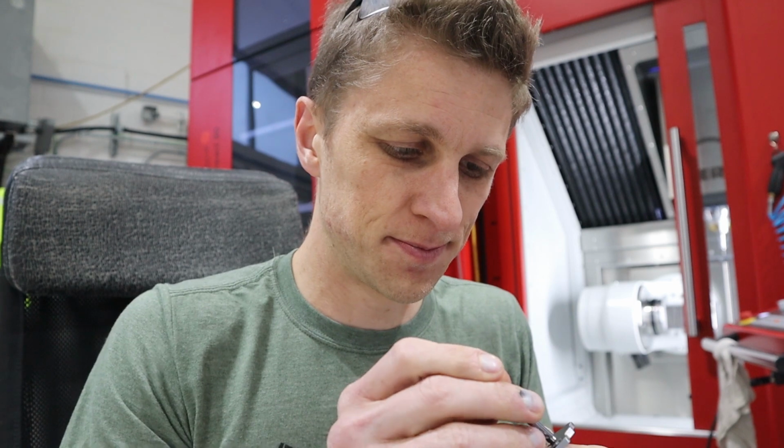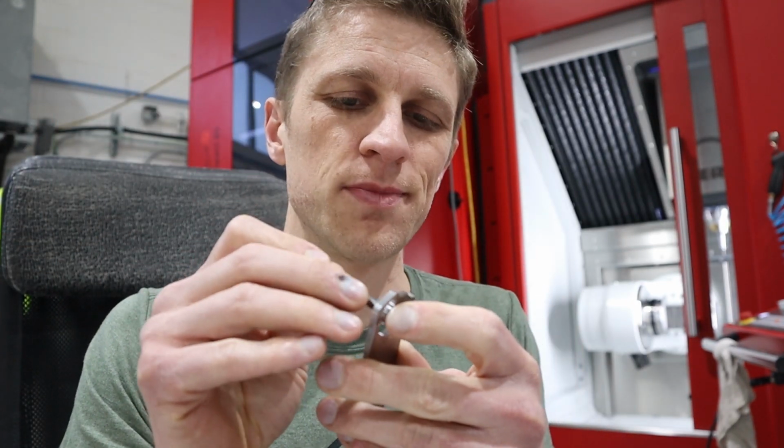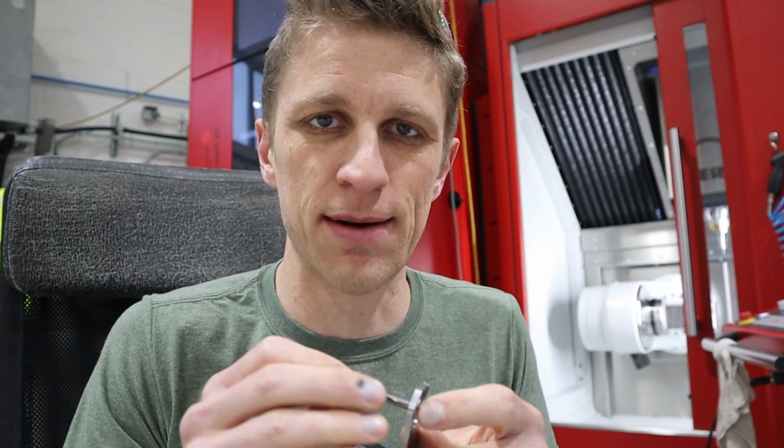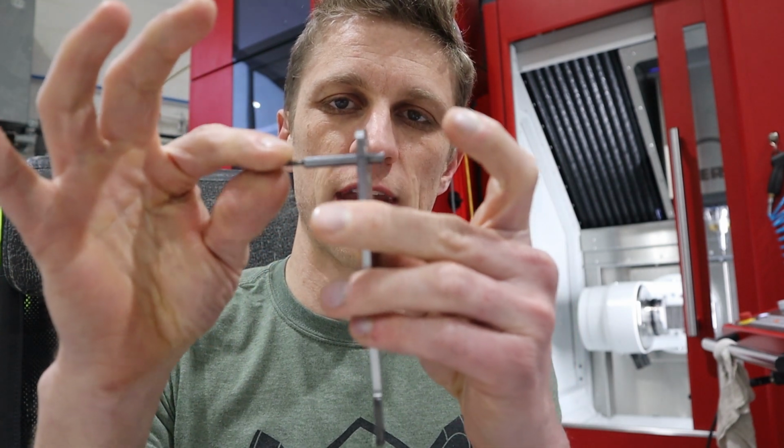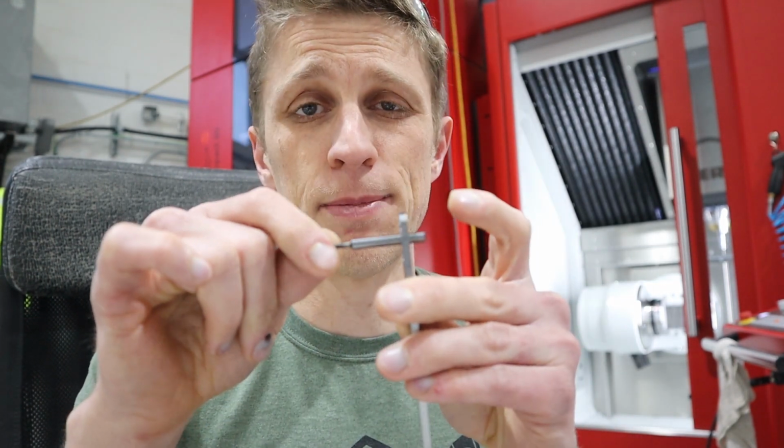Yeah, man. Okay, that's good. I've been playing with the pivot hole diameter, trying to get it right. I chamfer it, make sure the burrs don't go inside. I'm trying to get the diameter just perfect. This one's looser than I want, but I was playing with it. I was exaggerating my movements, and so now I know I've got to back that off a little bit.